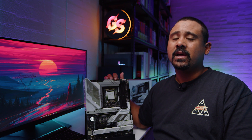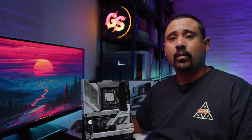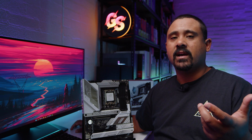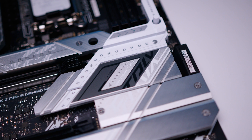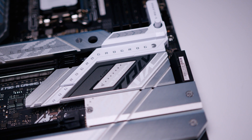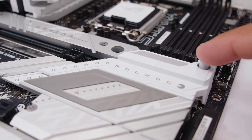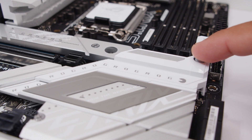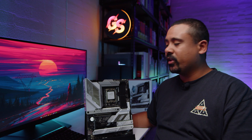Yes, there will be no immediate upgrade path, but we don't know that for sure. One thing I wanted to mention is that with the Z690 and X670 boards, there's that button to open the top PCIe slot. I think ASUS has gone one step further with this board and made it completely spring-loaded with no actual clip - you press the button, it opens and closes. When you push the card in, it clips in, and you compress it again to release. Other boards you press and it stays open, but this one closes itself and locks automatically. I thought that was quite cool and shows a bit of innovation.